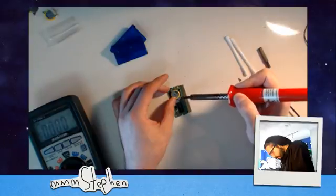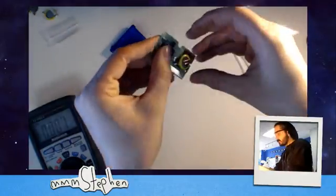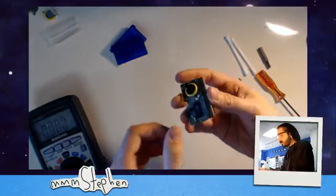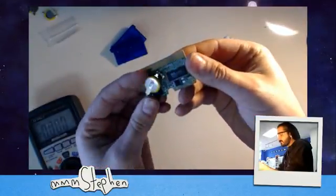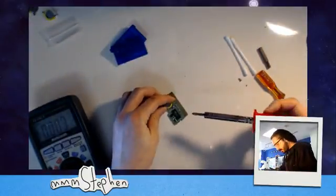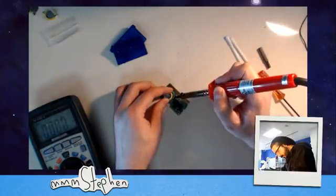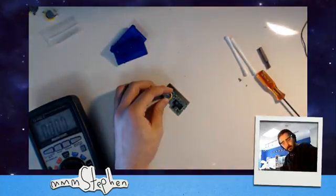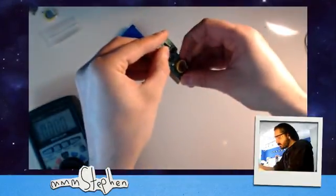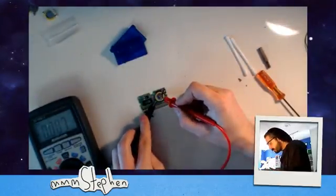Ugh, sweet. That one's nerve-wracking. Nice. Oh, shoot. See, yeah, that's why you always see me click these things with my fingernail. It's to see if this happens, where it just completely separates. So that is that cold solder joint I was talking about, where I didn't heat both metals properly. So I've got to be a little more diligent here. Alright. Let's see this guy. Perfect, that is in there. And I did hang the soldering iron on that for a little too long, so let's double check.